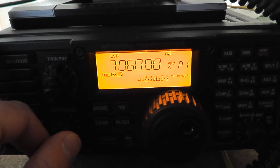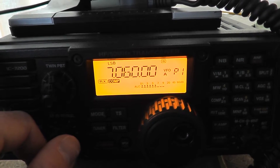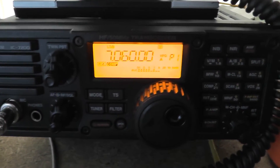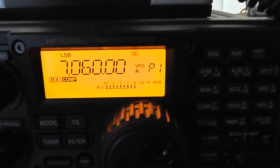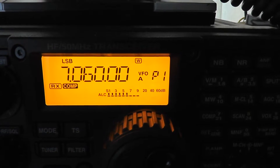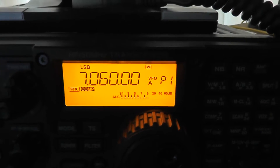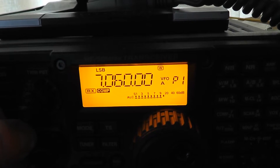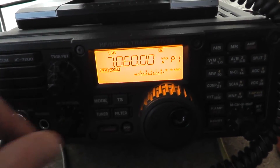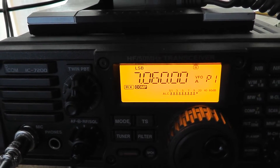Let's have a look at what's happening on the 40m band. This is reception on the delta loop. Now I flick over to the inverted V — see the noise there comes right up to S9. I go back, someone comes out of the mud, noise goes down to about S5. I'll just do that comparison again with the RF gain turned down a bit, and that's on the inverted V — the noise comes right up.